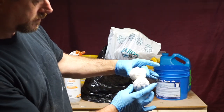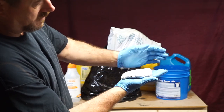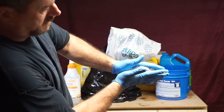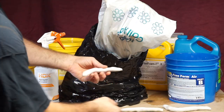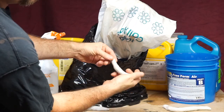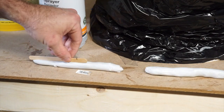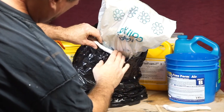You could use clay or something else for this part, but I'm a huge fan of Smooth-On's Freeform Air — always have some around the house. Roll up some Freeform just like a worm. Take a popsicle stick and make a nice slit down the middle — don't cut it all the way through, just making a notch. Attach the Freeform Air to the top of the chicken wire.